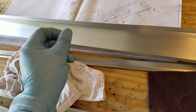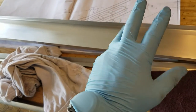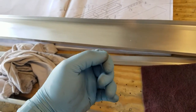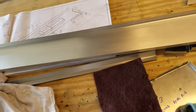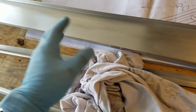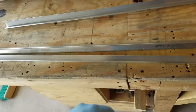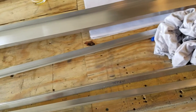If you run into this problem where you're scouring out corrosive etching, make sure you're not dropping sweat onto the part, and make sure you're wearing gloves to protect against sweat and oils from your hands — so you're not re-introducing something that can etch the metal before the aluminum oxide has a chance to coat back over. Once it's all cleaned up and there's no corrosive process going on, the aluminum oxide layer will reform over the part and you can handle it bare-handed without corroding it further. It's just when that aluminum oxide coating has been scoured away that the aluminum has no self-protection. So keep that in mind — you don't want to scour out corrosion and then come back a day later to find all your fingerprints have etched into the metal.